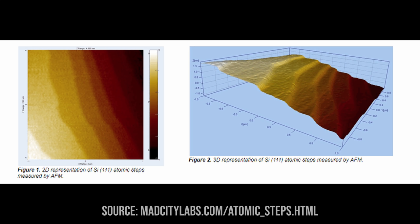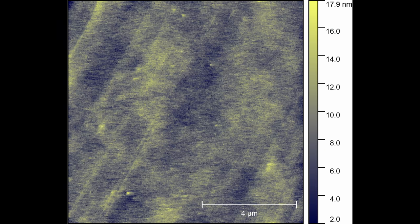But if you were to strip that oxide off and keep it under an inert gas or in a vacuum and scan it, the silicon crystal layer actually has a very very smooth surface and you can get some pretty impressively flat scans. Although it does have kind of a terraced or stepped nature to it, just based on how the crystal is formed. Some of this is probably from the slight unevenness of the silicon dioxide layer on top of the silicon and not necessarily the silicon itself, although some of it could be due to the grinding process as well. I'm not sure what the specs on this wafer are as far as flatness and smoothness.